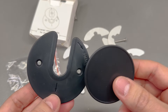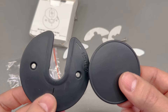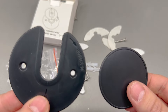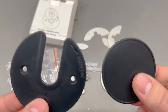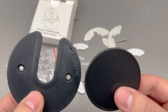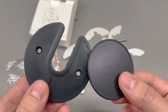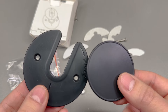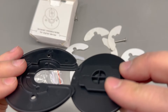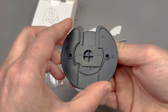Next up I have some Mechanic brand UV-curable solder mask for repair purposes. It comes in a syringe in liquid form and hardens once exposed to a specific UV light wavelength. I didn't have red and yellow, and recently I did some PCBs in red and yellow solder mask for a client that needed mods after assembly — it just looks much nicer and cleaner when you use the actual solder mask color to cover a bodge or mod on a PCB. I think I'm also missing black UV-curable solder mask, so I should order a tube of that as well.